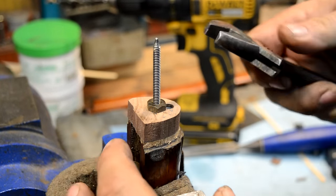Okay. So some of the things that I had to work around was, this is a mud escape hole here. If you're shoving this ramrod down through here, underneath and down into the bottom, you got to have a place if you get mud to be able to go in and clean this out. All right, so that's clean. We got all this stuff off the top here. We're good here. And yeah, I put like a 16th of an inch of this stuff in here. If you look real careful, let's see if I can actually get you to see it. There's some wood grain showing right there. You can actually see it's kind of brownish. It's not very thick, but it is there and it needed to be there.